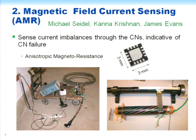And so we've been putting current through there, either through the concentric neutrals as a group, or maybe through the center conductor and the concentric neutrals as a group, or on our jacketed cables, we've done some experiments where we open up one of these concentric neutrals, cut the concentric neutral to make a measurement, and then close that connection again and see if we can tell the difference. So the idea there is, can we make measurements on a cable in the ground where a little bit of it sticks out in a vault, make measurements along that segment and tell whether there are any breaks in the CNs in the interior of the cable.